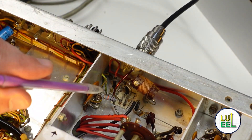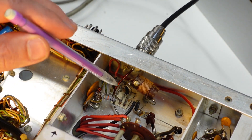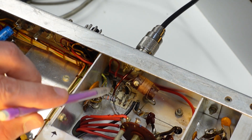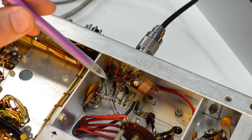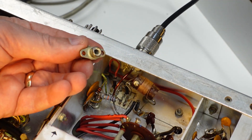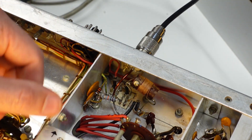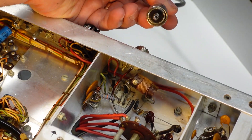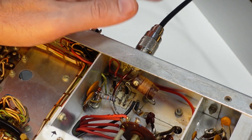I finished the repairs to this area. I removed those couple of pieces of questionable coax that were making that rat's nest, cleaned it up and reconnected everything according to the Heathkit assembly manual. This 10K resistor taps some of the RF energy over to a little circuit that goes to the meter — that 10K resistor was a bit high, so I just replaced it. And probably most significantly, I got rid of the phono connector that was the antenna connection. I have no idea why Heathkit would have used one of these — it's very odd for a rig that could transmit at least 100 watts of power. So the no-brainer was just to replace it with a conventional UHF connector.